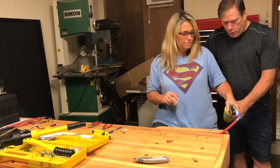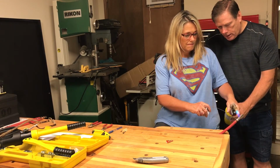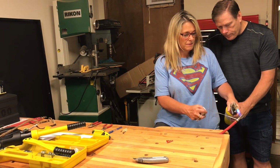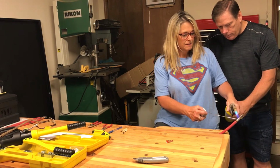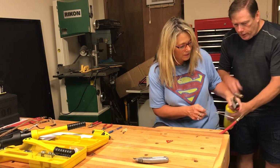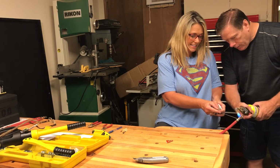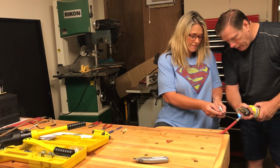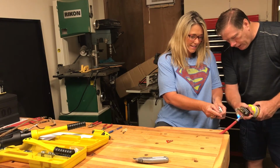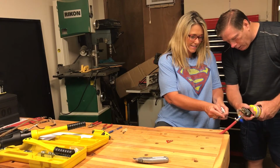I'll go ahead and put your solder right there, and you'll see it literally gets sucked right up. Well, it's not doing anything. It's not hot enough yet. Oh, there it goes! It did it! Okay, go ahead and feed it. I'll hold this while you do that. Feed it up there. Put it in there, right along that lip. Just work along the edge of the lip and feed it through. And you'll know when it gets full because it'll start to pile up along that lip.